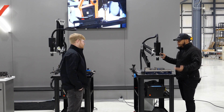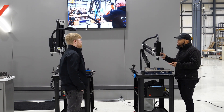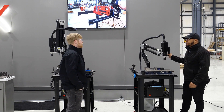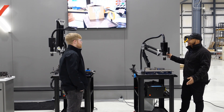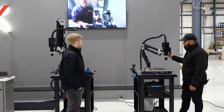So it doesn't matter if you're going into aluminum or something harder like stainless. In stainless steel, this will give you about nine-sixteenths capacity, give or take. If you're doing aluminum, brass, or plastic composites, you're looking at about an inch to inch-and-a-quarter capacity. Still quite a bit.